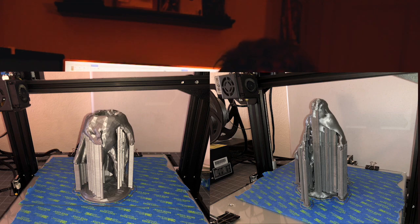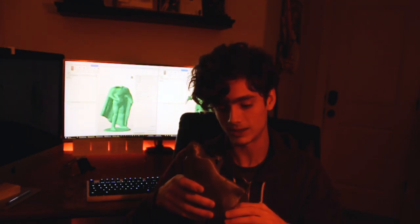Moving on to the photogrammetry piece — I believe this one took over 30 hours; I actually had to leave the house and go to another town while it was printing, so about 34 hours total. It did require much more support. There had to be support up through these bits following up the gun, the arm, and underneath the cape — just a ton of supports. That is due to the models obviously not being optimized for 3D printing, since I didn't sculpt them from scratch aside from the back retexturing. I just printed them as-is, which I thought would be part of the project and kind of the fun.